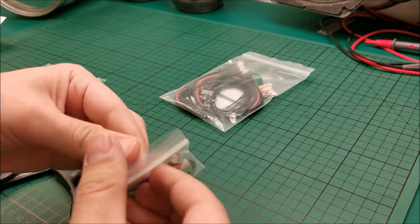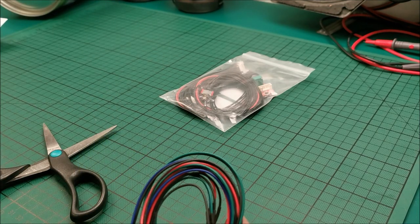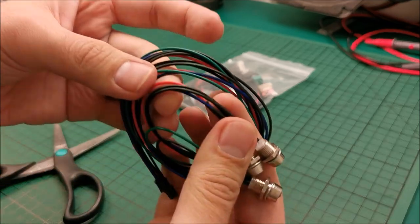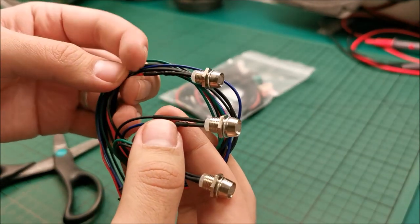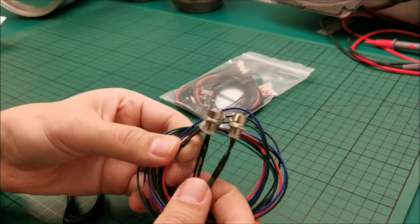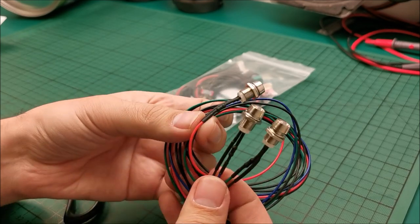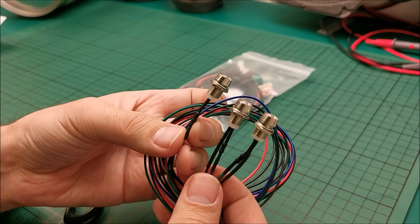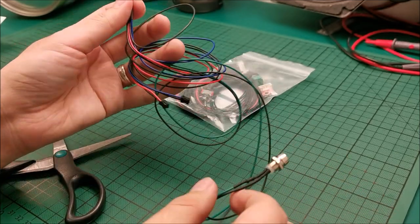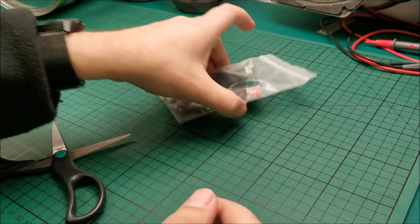We have our LEDs. Because this module can also be used with lithium batteries, we have a red charging LED. They are color-coded by the positive wire, I think. A blue Bluetooth LED and a green power LED. I'm not sure if I will use all of them because I'm not using a battery. I might be just using red as power because I like red LEDs as they were used back in the day for power, and blue for Bluetooth, and green I might be hanging on to it for a future project, maybe. I'll see about that.